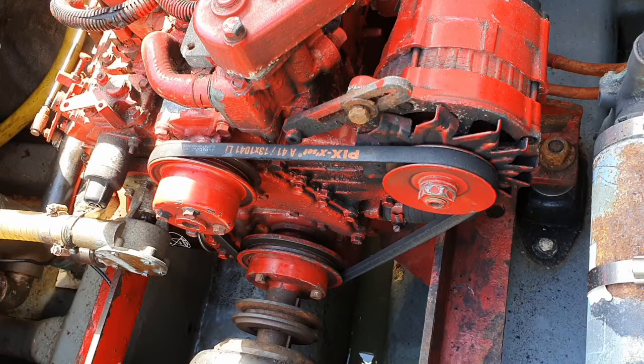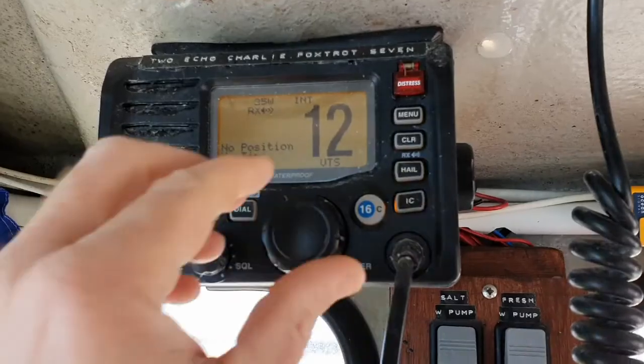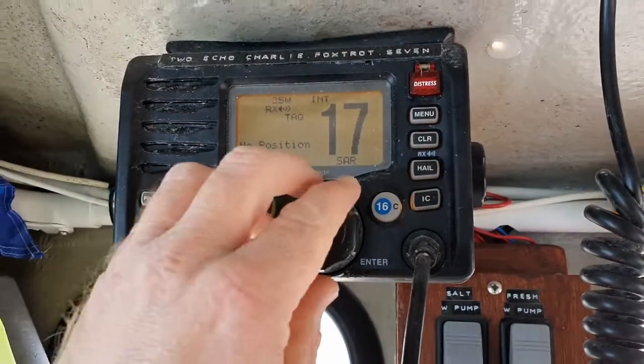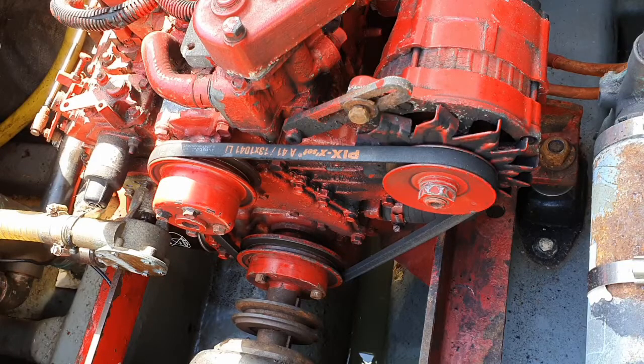Step 3 is to call for help and quickly explain the situation. If you're on the East Coast, my preference would be to call VTS on Channel 12. For everywhere else, call Guernsey Coast Guard on Channel 16. With a diver in the water, you are technically a mayday, but at this point I would advise the VTS or Coast Guard that you have broken down with a diver in the water and that the situation should be fixable within approximately 5 minutes.